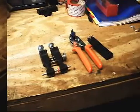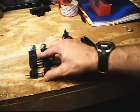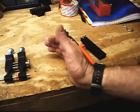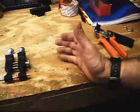Just one more note to recall on the green round belts when you put them on. It's 2 minutes in the clamps. Then the Brunswick instructs you don't put it on the machine or put any tension or stretch it out until 10 minutes after that. So you're looking at 12 minutes total job of re-welding the belt before installation.